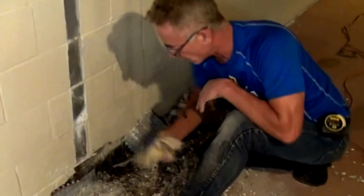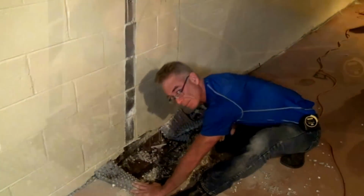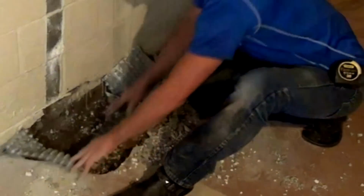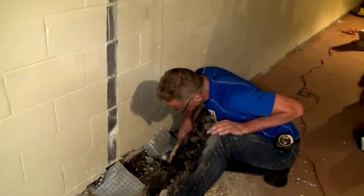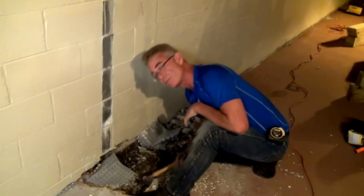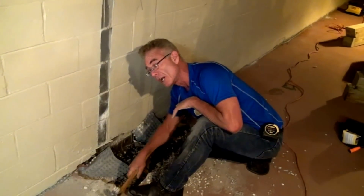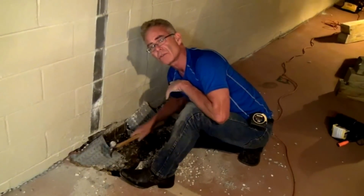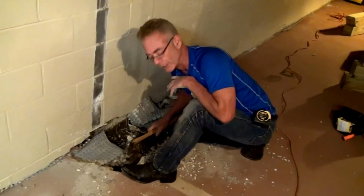This is a wall, by the way. Here's the pipe. There's your footer, there's your pipe. And I haven't even dug this out yet. Now this, right here, this is dirt. Which means to say that all they did was break out the concrete for show, and they dug a little narrow trench just to put the pipe in, which is why the system will never work.